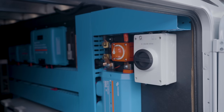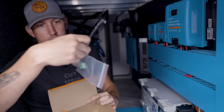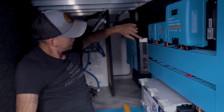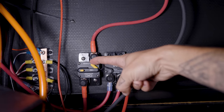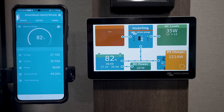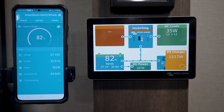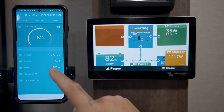With programming done, we can now turn everything on and check that the system is working. The master battery switch is already on, then we turn our solar isolator to on, get inside our Orion DC to DC charger box and pull out the two green pins for each of the Orions and put them into the remote port on each of the Orions, then turn the MultiPlus power switch to on. On the other side we turn the Orion 24-to-12 70-amp converter breaker to on so we can charge our factory 12-volt battery from our newly upgraded 24-volt battery bank. Now we can come to the Cerbo GX Touch 70 screen and see that our system is actually working, and I've also got it pulled up on the Victron Connect app on my phone - you can see pretty much everything you can see on the Cerbo GX through the app as well.